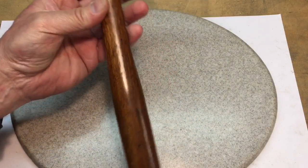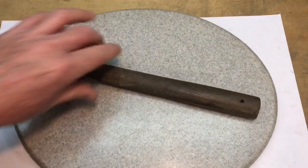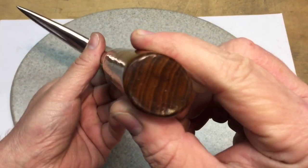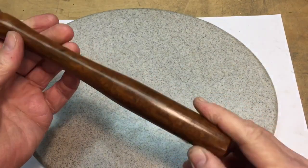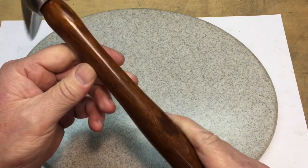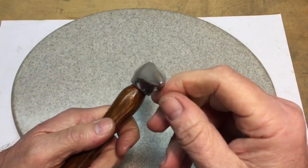And the handle came out. Now, remember, this handle was off of the ball peen, was off of this one here, and it was covered in grease and tar. And look how nice we got this. Cut off the bottom here. Gave it some gun stock treatment. Two coats of shellac. Then waxed it. But I've been playing with it a lot. So I think it's very nice, right?